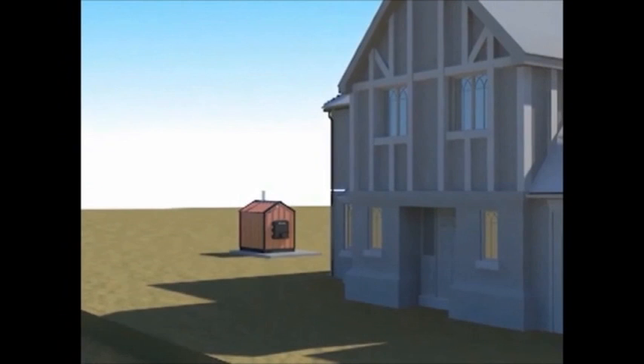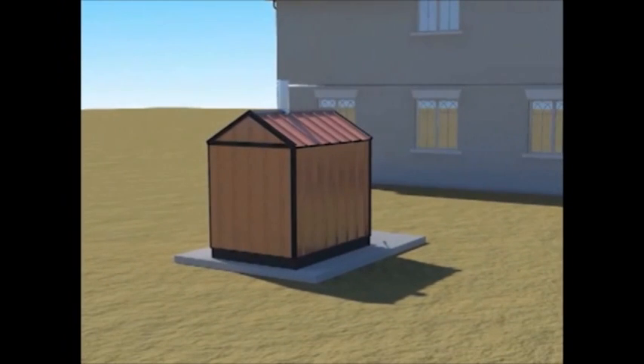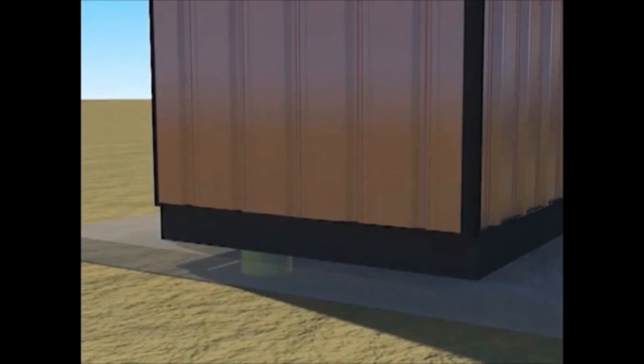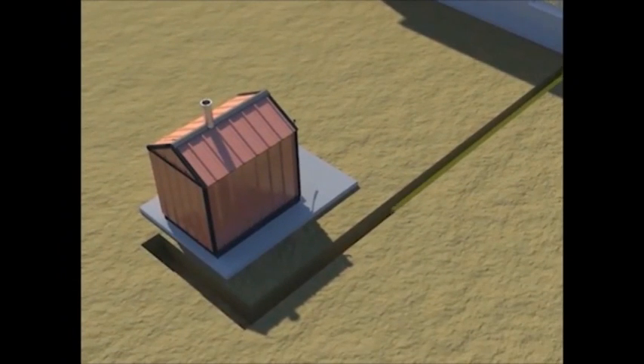Here are the steps to install an Earth outdoor wood furnace. First, find a suitable site for the furnace — it should be level and easily supplied with wood. Next, pour a cement pad to give the furnace a firm foundation. Remember to leave a hole in the center near the back of the pad where the power and water lines can enter. Dig a trench from the rear of the furnace to the house, cut an entry hole to run lines into the house, and lay the line system in the trench, stubbing the ends into the house and back of the furnace.